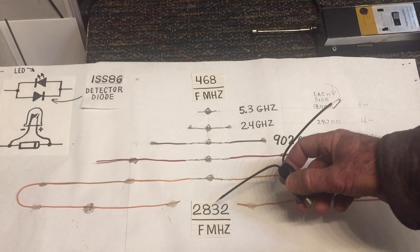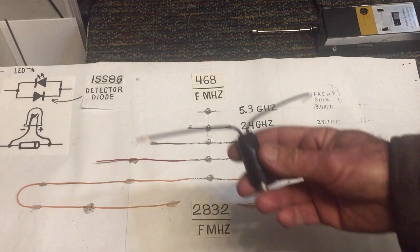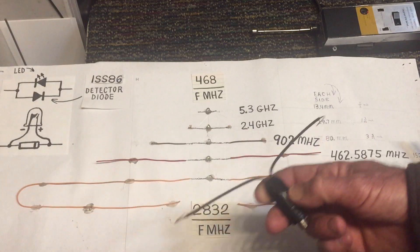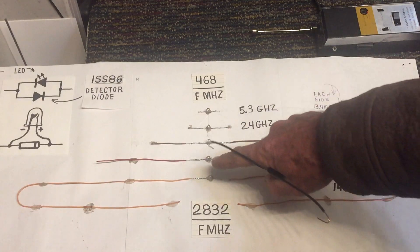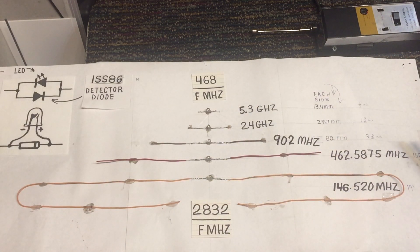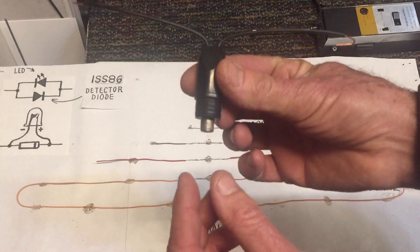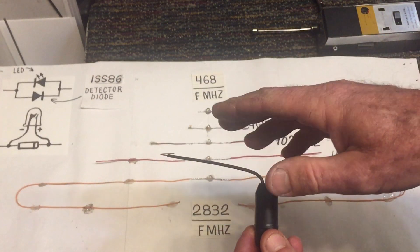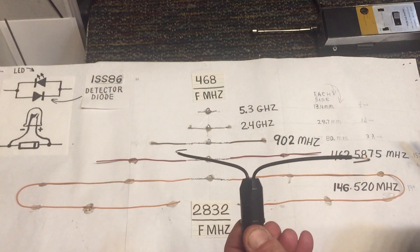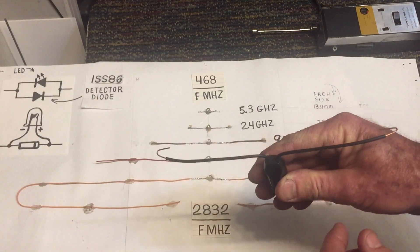The formulas here are for what you call half-wave dipole antennas, and that's essentially what I've got in my hand here — and that's pretty much what these are too. The only difference is these ones here have a little LED in the middle just to help with this demonstration. If I wanted to hook a piece of coax onto this connector, this would actually be a halfway decent antenna for some frequencies. It's not going to have a lot of gain because it's just two elements.